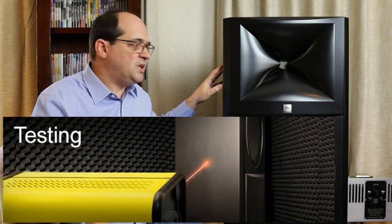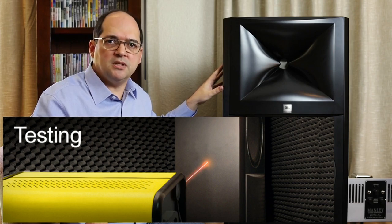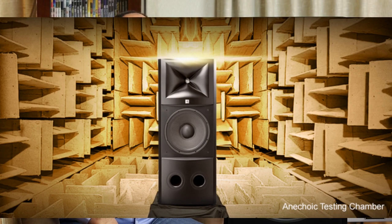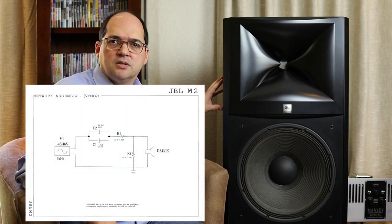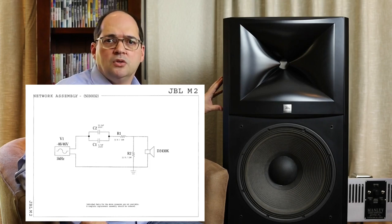Another component is the actual enclosure, where JBL also spent a lot of time. It's typically one-inch MDF material to give it ruggedness and to ensure damping inside the cabinet. It has two ports — a dual-ported bass reflex design — which we can't see in this frame but I'll share a picture. There's also a DC protection circuit for the tweeter, a high-pass configuration that won't allow low frequencies to reach the mid-range compression driver.